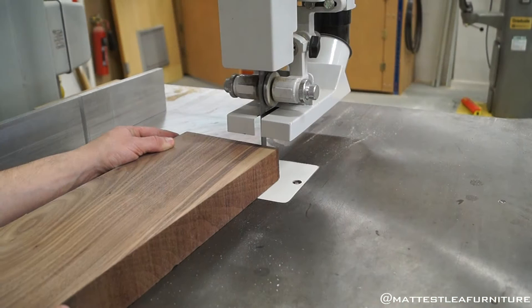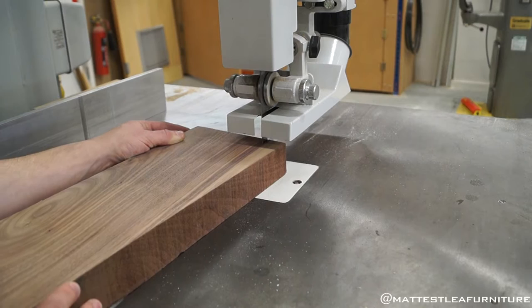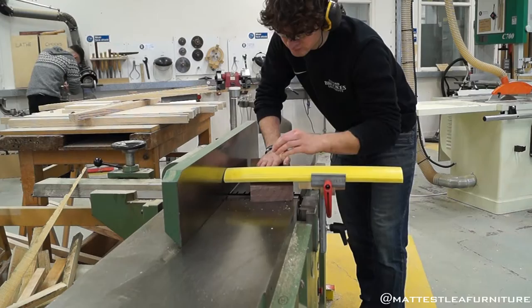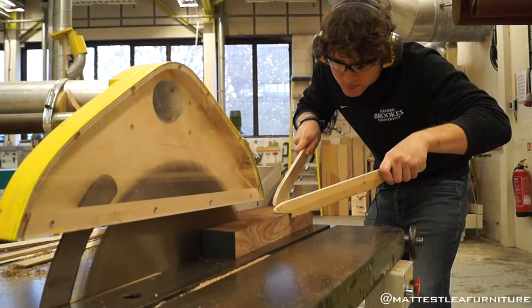Because I'm fussy, I wanted to have the grain on the drawers go as horizontal as possible. So here I'm just cutting an angle in the edge of the block of wood to match the direction of the grain — planing a flat face on that and then the flat edge.